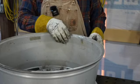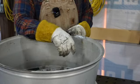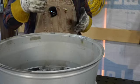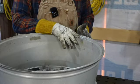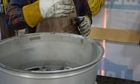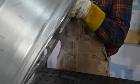If you wanted to finish it, you'd finish grinding that smooth, and then you'd have to go through a process of sanding it with different grits until you get to, I want to say, 300 or 400, and then you can start actually buffing. Basically, what you're doing is getting more and more scratches out every time. So you get the scratches from this flat wheel with a 100 grit or whatever, and then you'd go to a 200 all the way up to 400 grit, and then you would go to a buffing pad and use compounds and what they call rouge to buff that out. It's just getting finer and finer. Still has scratches, but they're super, super fine.